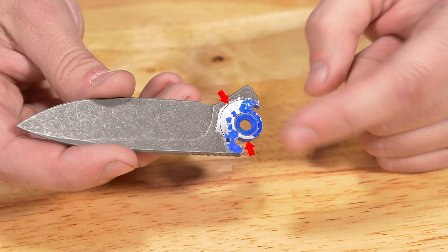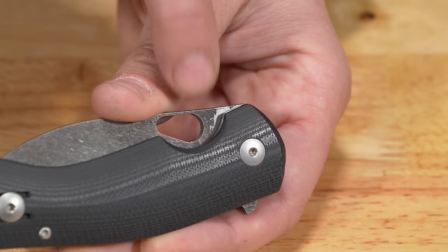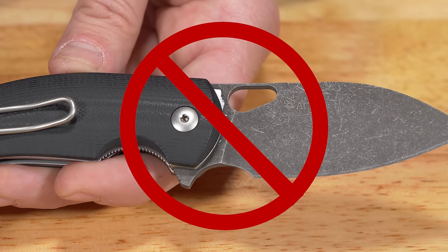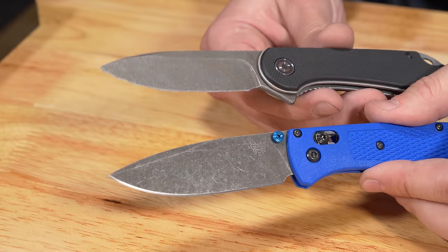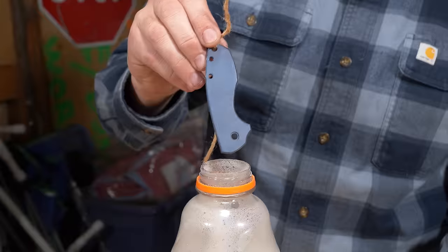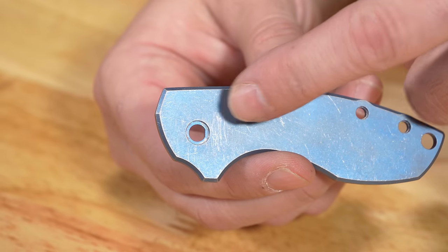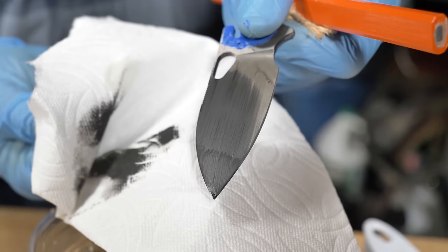Make sure you don't stonewash your blade for too long, otherwise you'll remove your protective nail polish. Make sure not to shake too hard, or you could damage your blade. We can't stress enough how important properly painting on your nail polish is — if you overpaint, your blade will end up with an uneven finish. For a lighter blade finish, you can stonewash longer, which will also hide imperfections in your acid etch. We tried stonewashing a titanium scale using this method and did not get great results with our chosen medium — do so at your own risk. To see the true color of your etched blade, you may need to rinse and wipe it off.